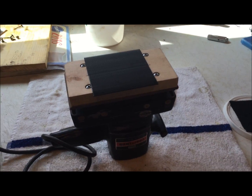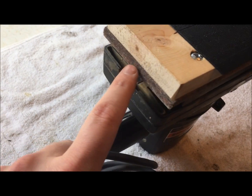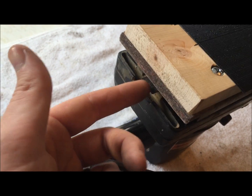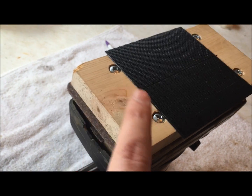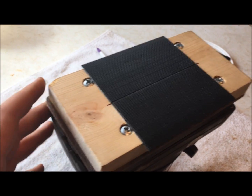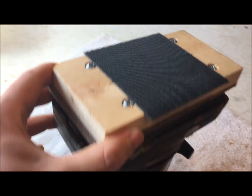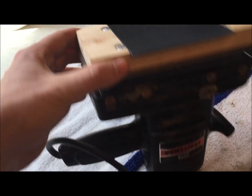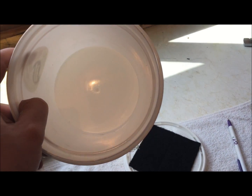Continuing on with this ultrasonic cleaner made from an orbital sander. What I did was take the shroud off and this is the backing plate — normally you'd clamp your sandpaper in there. When Ichiban did this he just bent some sheet metal and stuck velcro to it. I decided to completely take this off, got some longer screws, cut a piece of one-by-four, drilled a couple of holes in it, got it screwed on, put my velcro on there, and got the velcro on the lid too. We've got our bucket and I think we're just about ready.